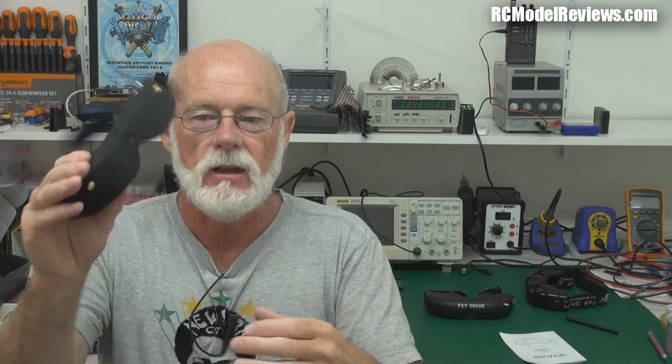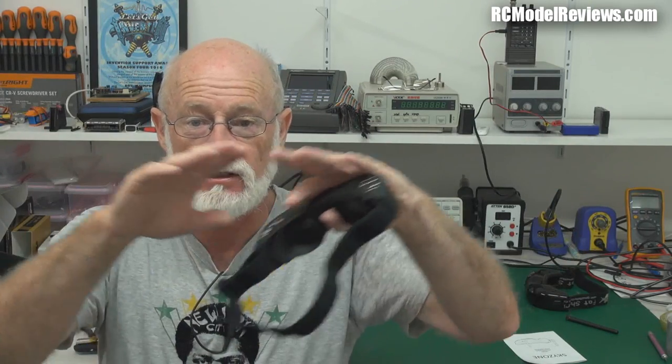Now, I haven't tried them yet. I'm going to give them a try. But WVGA is interesting. You know when you have your TV, the old TVs were pretty much square. They were 4 units across, 3 units down, so an aspect ratio of 4:3. And your new TV, your big HD LCD TV in the living room, is 16 units across, 9 units down. So it's stretched out sideways. That's the new standard. Well, these have LCDs that are the new standard. They're 16:9 and WVGA, with more pixels in the horizontal plane.